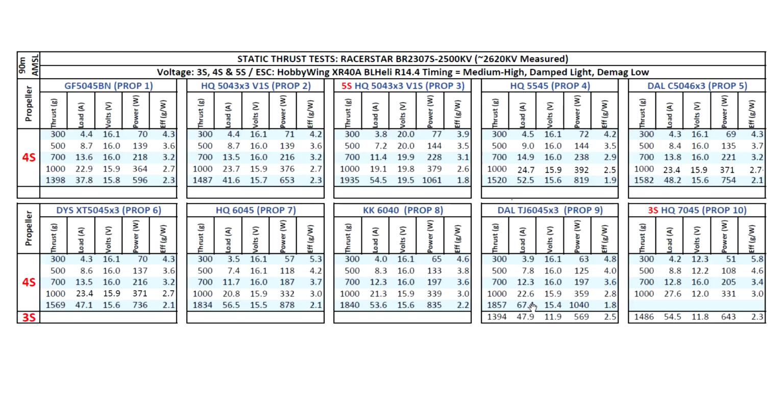Of course, this is a budget motor, so they're not using top-notch wire. So that's why sometimes we get a puff of smoke where other motors won't show that. But it doesn't mean that the motor cannot run this prop in the air. It's going to be unloaded. Same thing happened with the 7045 on 3S. There was a little bit of a puff of smoke, but I think I should be able to run it. But still, make sure you check the temps if you run these props on these motors.